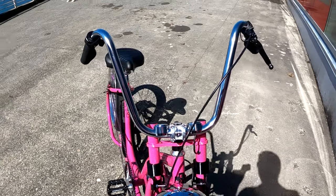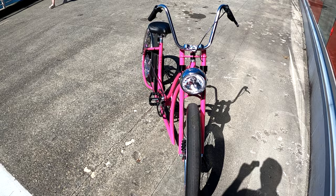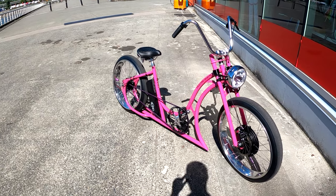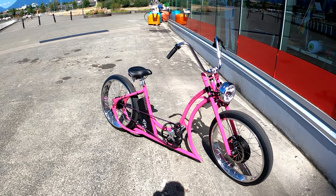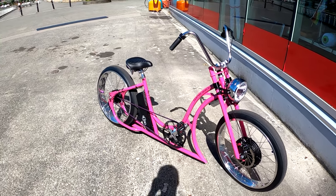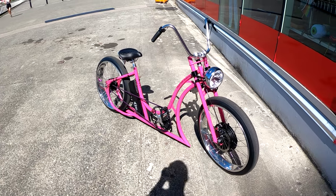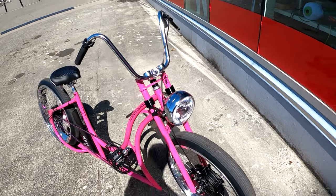I did a basic setup for this one because we don't care about too much speed and too much power. Mom's gonna be cruising around. All the ladies gonna be cruising around. It's not about that kind of stuff, but it's about control and power. Okay, it's got dual regenerative braking. So with the one lever, it activates the dual regenerative braking, and it's set up together. And the pressures of the braking are also programmable, which I adjusted separately, and they're both different, obviously.